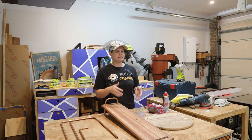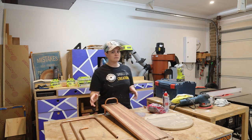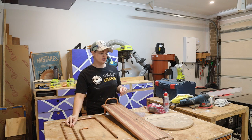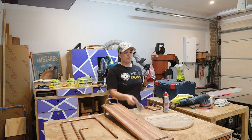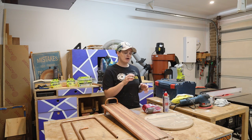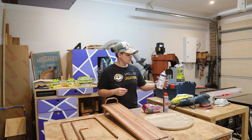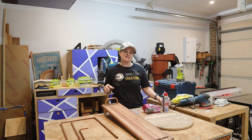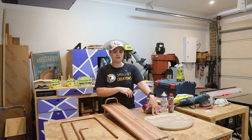When it comes to finishing the timber, it's really simple — just sand everything up to 320 grit, pop the grain part way through with some water, and then apply finish. When it comes to the copper it's a little bit different. If yours is like mine it'll have already started to patina, but you can get it back to a nice shine. Pick up some very fine steel wool and some 600 grit sandpaper — use the 600 grit sandpaper to get rid of all the patina and start to shine up the copper, then come back through with the steel wool to bring it to a really nice shine. To stop it from patinating in the future, just use some clear satin spray — maybe three or four coats — to protect it.